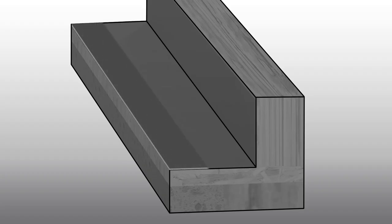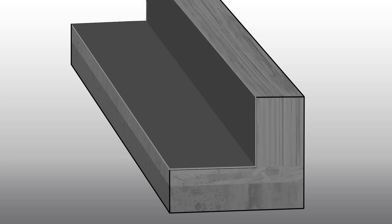Before you lift the roof light into place, you need to mount the control box in the desired location — for example, a ceiling void. You may put an access panel in at your discretion. We recommend you trial fit your roof light. Drill the holes for the electrical cables and get these connected to the control box by a qualified electrician. Bring your roof flashing up the side of your upstand and apply a thick bead of silicone all the way around the timber curb, about 20mm from the outside edge.